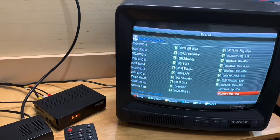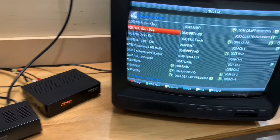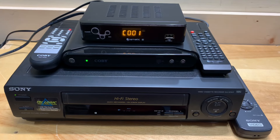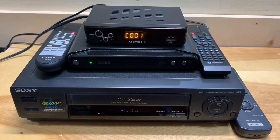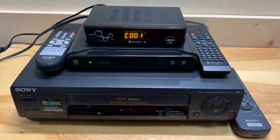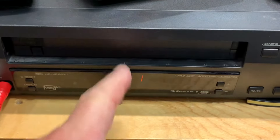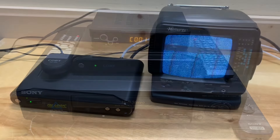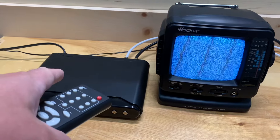Now you can go ahead and use your receiver and watch satellite TV. Keep in mind this does not give you an HD picture, but if you're using an old CRT then you're likely not concerned with that. Devices like VCRs and digital converter boxes use RF modulation as one way to send content to your TV — most people probably remember having to put the TV on channel 3 to watch a VHS tape. You can still use that concept today to send content to one or more TVs in your house.